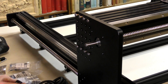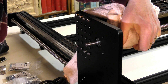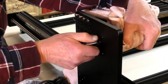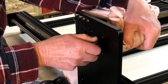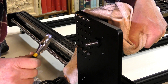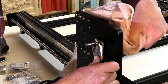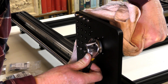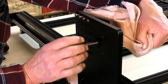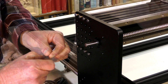The machined surface goes to the bearing. You'll need a cloth — catch hold of the screw with your hand, put this on, and screw it all the way down. Then hold the screw with a cloth or rag and just ease the nut up. Once the thread starts turning in your hands, that is the correct tension — no need for any more than that.